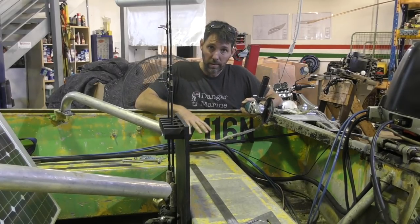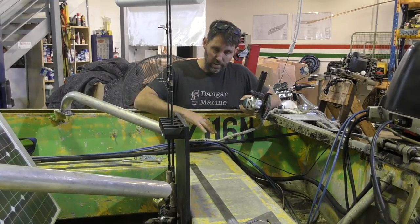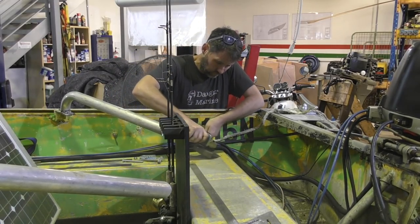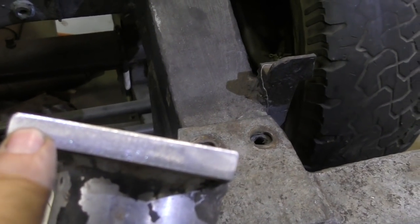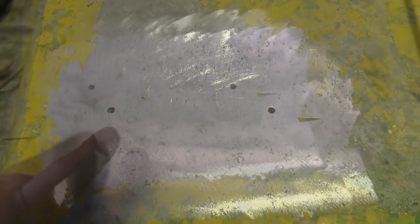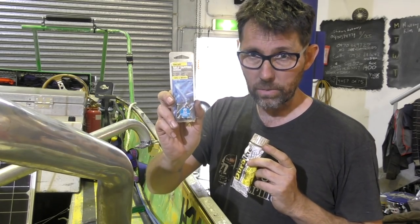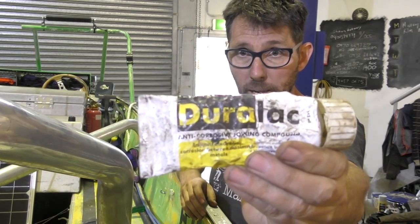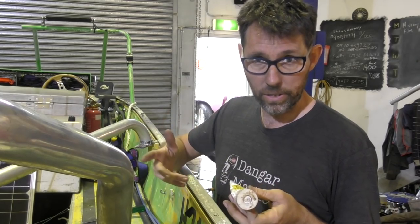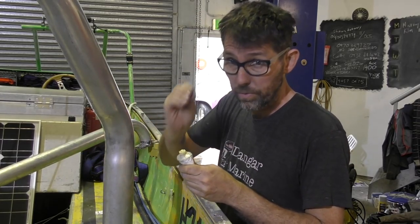Because I've already drilled a couple of holes in the seat to temporarily screw the crossbar down while I weld it, I can sand off all my old marks — I'll still get in the right position. The edges of the flanges I'm going to be welding are now nice and clean, slightly bevelled, and the part of the seat I'm welding to is relatively clean. Now I'll screw the crossbar down and tack weld these arms onto the upright. Because I'm putting stainless steel screws into aluminium, I'm going to put a bit of Duralac on the threads — it's a jointing compound for dissimilar metals to stop galvanic corrosion.